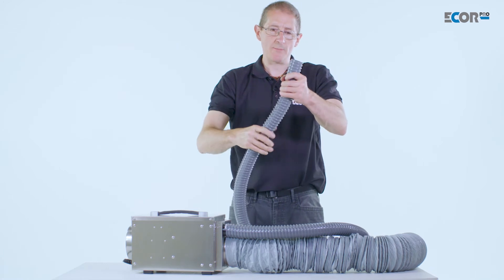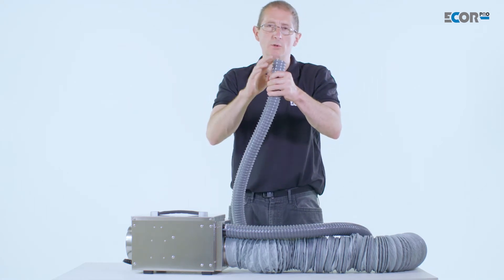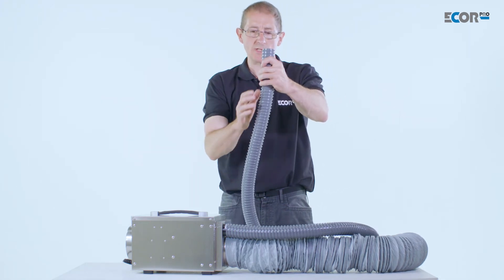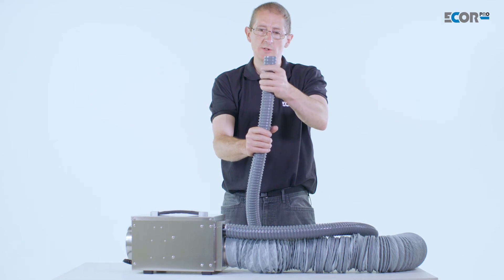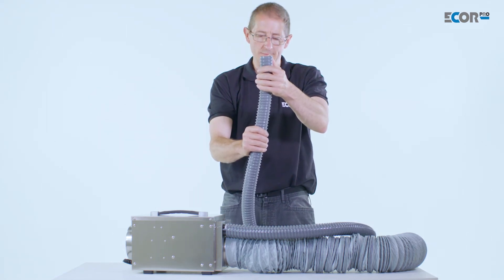The condensation or dew point temperature inside here is going to be quite high, so if the air around here is cold, condensation would form. The two ways to stop or reduce that: first, make sure that the air around the pipe remains warm. If we couldn't do that, the better solution would be to insulate the pipe to prevent that condensation from forming.